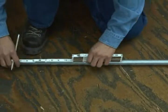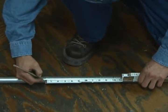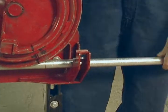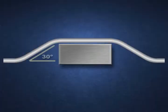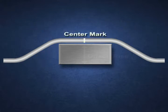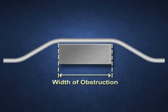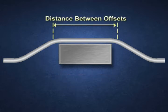With the push-through method for four bend saddles, the conduit is laid out the same as with a hand bender. With the Mechanical Bender, all of the bends are aligned with the center of bend benchmarks on the bender shoe. The angles are chosen, and the distance between bends is calculated. The rise is measured, and the shrink is calculated and added to the center line mark. The width of the obstruction is measured and used as the distance between the two offsets, along with an adjustment for using the center of bend benchmarks.